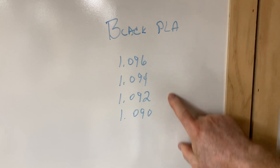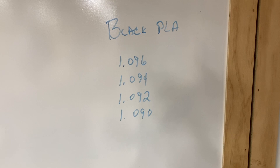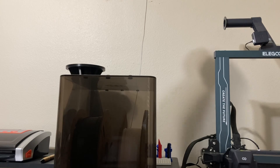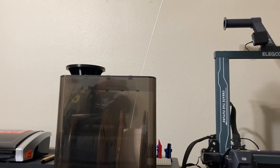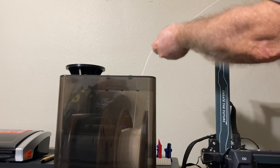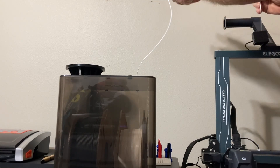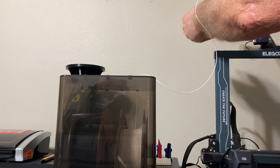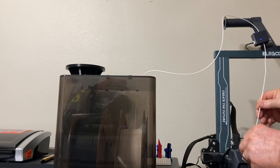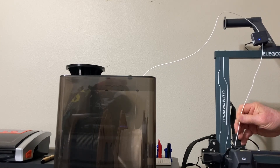So I'm very impressed with how the FixDry filament dryer unit actually dries out the filament and makes it ready to use again for prints. I'm going to set this up again with the filament inside of the dryer, running it through one of those little rubber grommets and then over to the machine. You can see how this filament is reacting — it's much, much different. It's not brittle anymore. It is flexible. I can move it and not worry about it breaking.